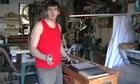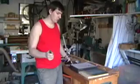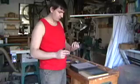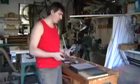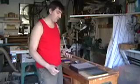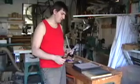I won't go into too many details about how I'm sharpening my tools. This is a story for another video. What I'm going to do is essentially use a scary sharp system. I got this Veritas jig that I really like to use now. I'll start with sandpaper 220, then go to 600, and then start using this very, very fine sandpaper. You can actually buy from an auto shop, or they have some stuff online.